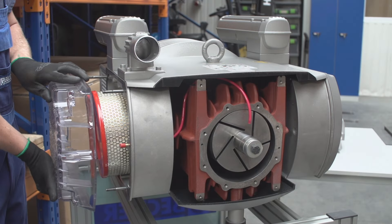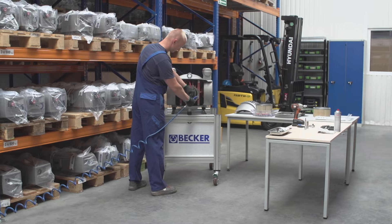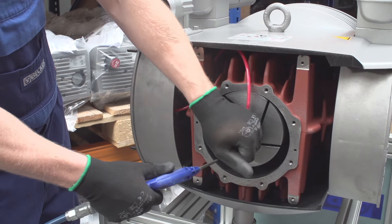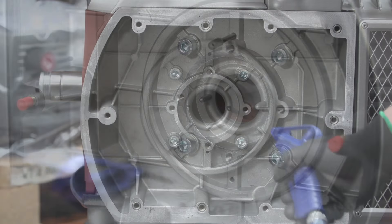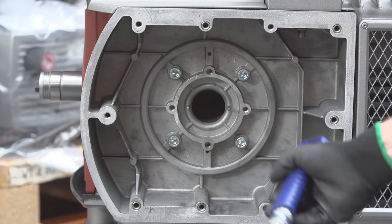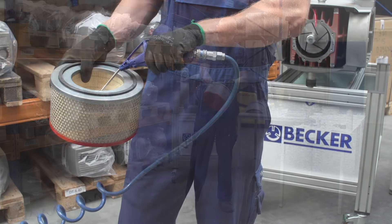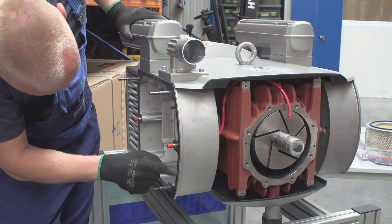In order to remove any vane dust, remove the covers. Blow out the suction chamber, exhaust port, and intake port, then blow out the cylinder while rotating the rotor. Using compressed air, blow out the inlet filter from inside out. To avoid damaging or denting the filter element, never tap it on a hard surface. Also check the condition of the gaskets under the suction cover and exhaust chamber. If the filter is too dirty, replacement is recommended.